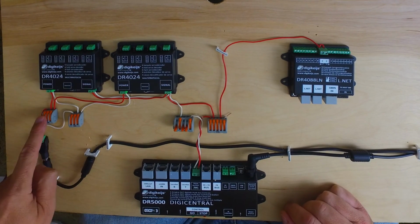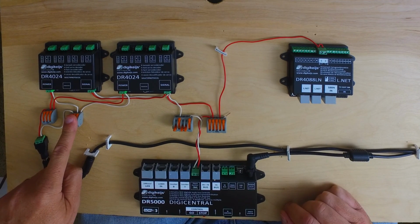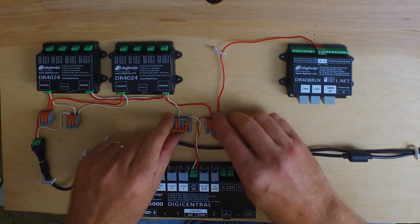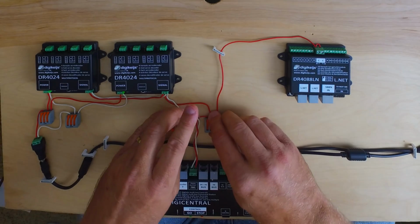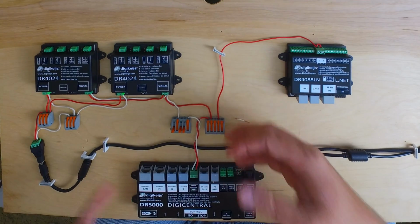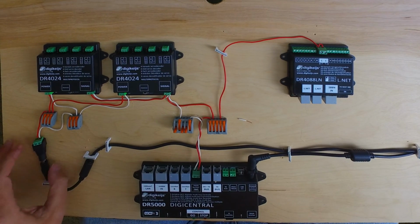And then I'm going to have to change out these connectors. These connectors are only 3. I'm probably going to use 6 WAGO connectors. And these over here are hot glued down, and that's what I did the last time, and they stay in place. The only way they're going to move is if I get some alcohol. I can put some alcohol in there and it dissolves that connection with the hot glue, and then it'll pop up.